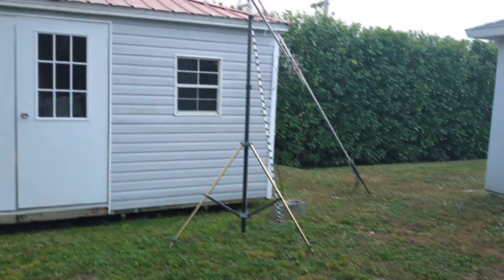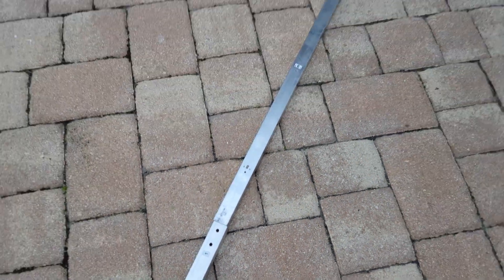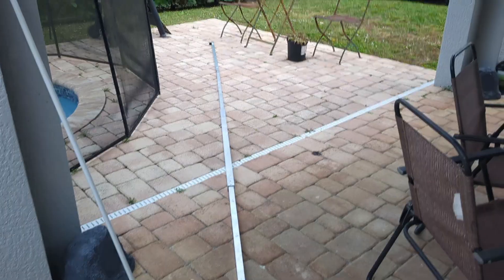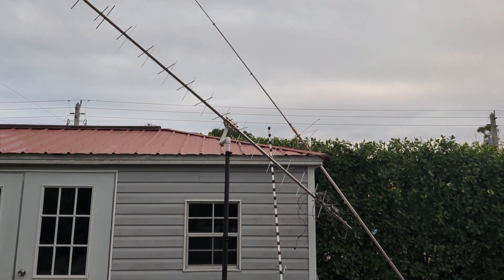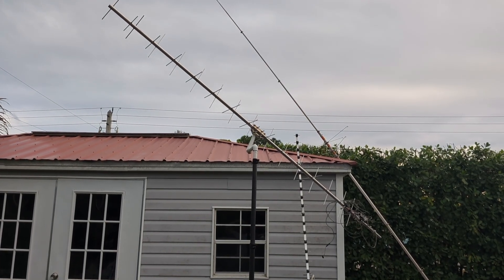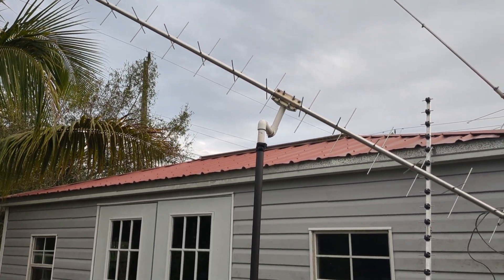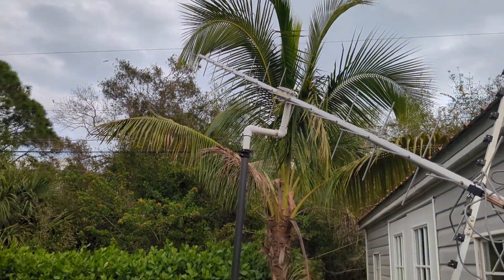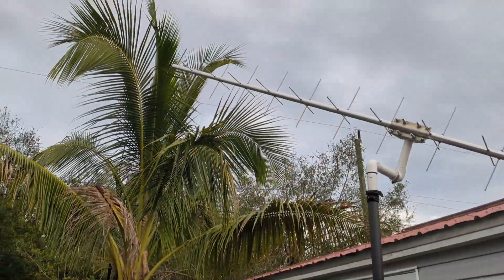This is the second antenna — the first one I ordered is right there, that's the 1.2 gigahertz. Until you really line them up like this, oh my God, that is a long antenna. That's going to go on that tripod right there where the other one is — the one I made a couple of Moon Bounce UHF contacts on. That one is a circular polarized 16 or 17-element with a switching network; you apply 9 volts to switch from right-hand to left-hand circular polarization. I'm probably going to end up selling that because I wanted something better.